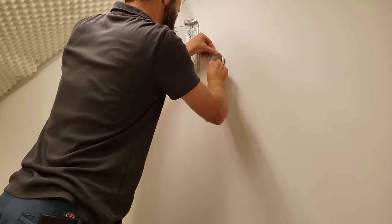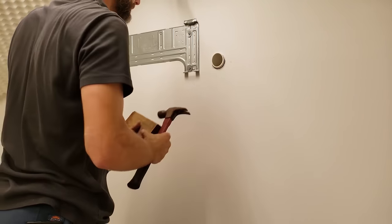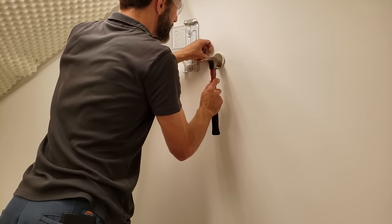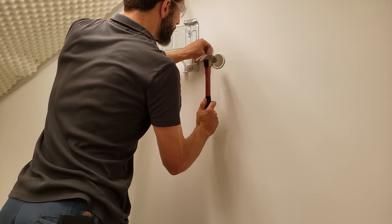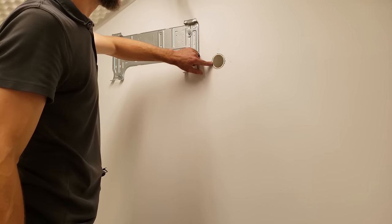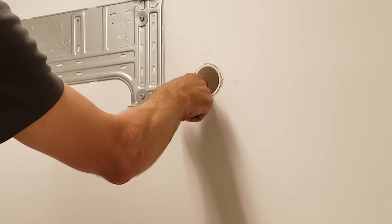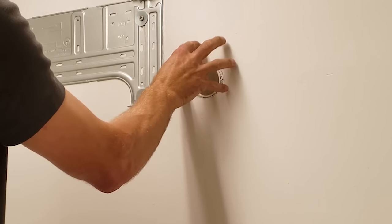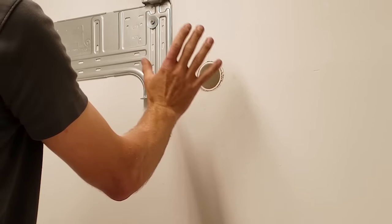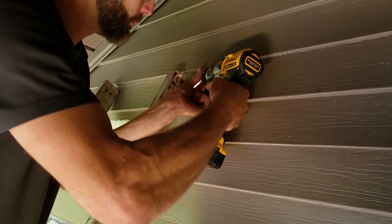So now we have our piece of PVC cut and filed on the inside with our round file to take the edges off so nothing gets caught when we're fishing our tubing through. We'll go ahead and put this down in there — it's going to be snug and that's what I want. I'm going to put out just a little bit of silicone around here before we go fishing our tubing through. The whole point of using this PVC is to have a nice sealed-up inner wall. Once the mini-split is in place we can't get to this hole again, so we don't want any heat loss, insects, or any issues.